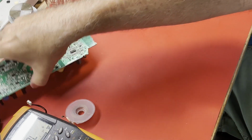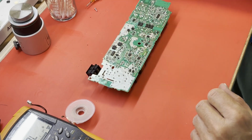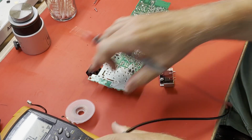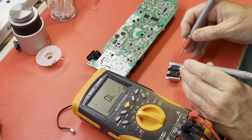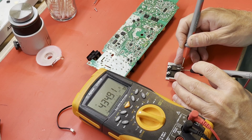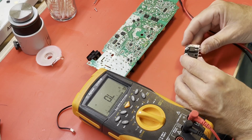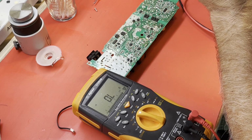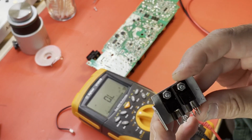Okay. Where's that? Here we go. Just confirm that we still have a short. She's not shorted between these two pins, but it's 434 ohms. That doesn't, but she's dead shorted there. What is this MOSFET? And do I have one? 24N60M2. I don't know if any chance that picks up on the camera.